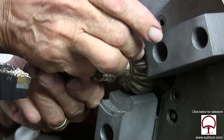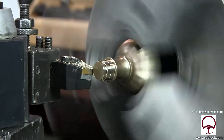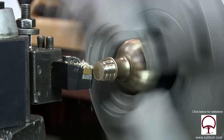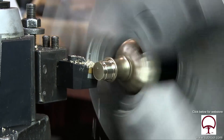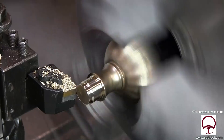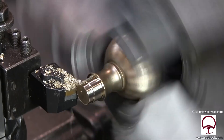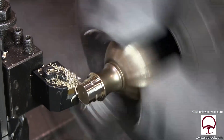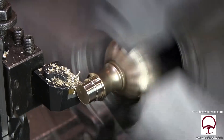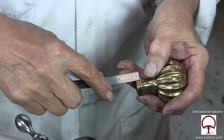So I'm checking it here again, and it looks like I'm okay with what we have. So now we can take our cut all the way up to the shoulder. I like that shot right there where we can show it nice and clean — the shoulder's nice and clean. And remember folks, this is not a critical dimension. It needs to be within five thousandths or so, so it's not real critical.